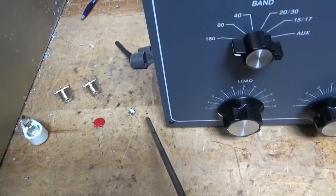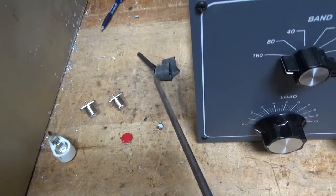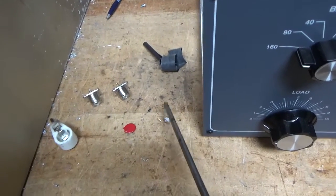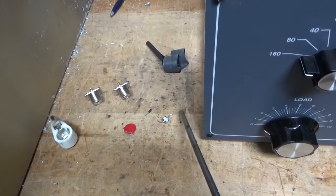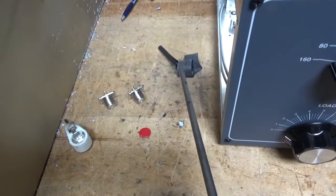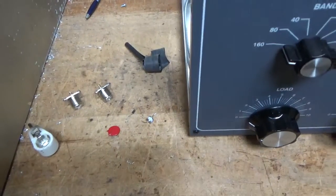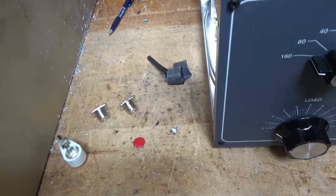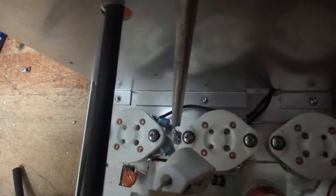They've done a lot of revisions over the years. The early ones didn't have gas discharge tubes, and they started putting them in. I always take it off the board because if a tube flashes from the anode to filament, I'd rather have it brought to ground at the base of the socket instead of going through the circuit board — you end up damaging traces and can damage other components too. So I put two down here, as you can see, one per side of the filament. All these sockets are in parallel, so you only need one per side.